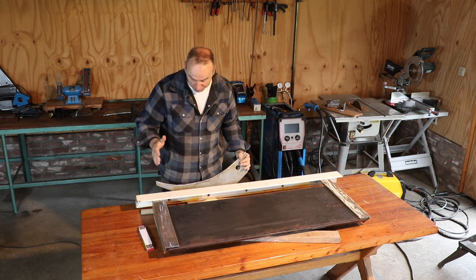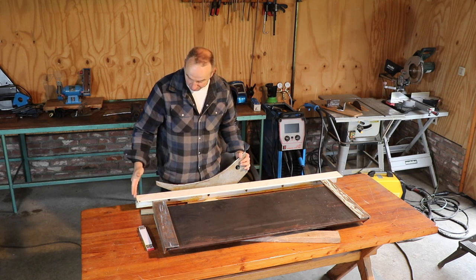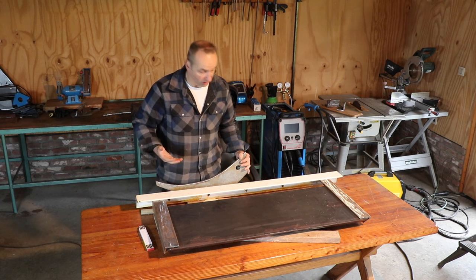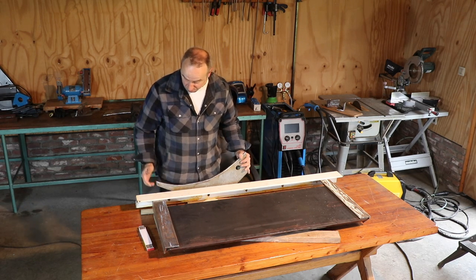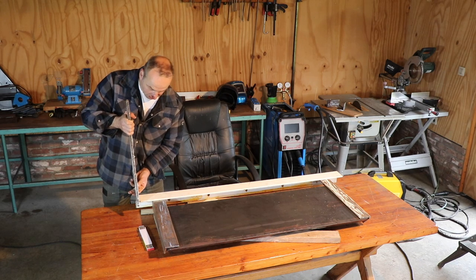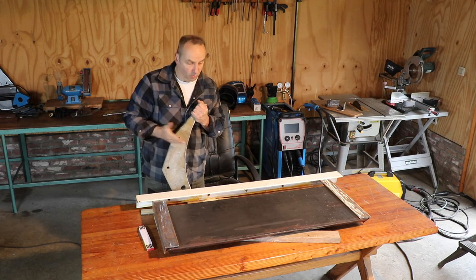Now I could have the width of the Rake Digger at exactly the same width as the interface plate, but I decided to make it a little bit longer. Now it has just the same width as the bucket has. The advantage is that I like to loosen up with the rake and scrape it up with the bucket. Another advantage is that I can now have a little bit of a side view when I put the rake exactly at the edge. That's what I intend to do. So then when I sit at my Kubota, I can just look at where the sides are digging.